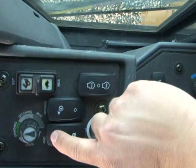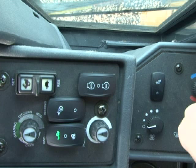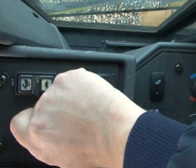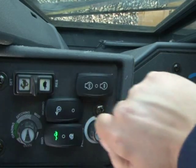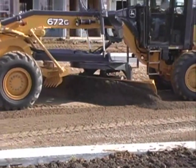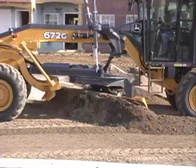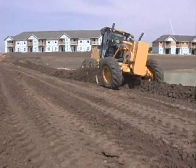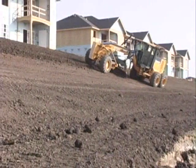Pushing the button activates the 6-wheel drive system in 1st through 7th gears in both directions on 700 and 800 series models. Once on, the aggressiveness dial is used to fine tune the front wheel speed in relation to the rear wheels. When the dial is in the center position with the arrow pointed toward the notch, front tire speed matches rear tire speed in forward and reverse. Turning the knob counterclockwise decreases the speed of the front wheels relative to the rear tandems; turning clockwise increases front wheel aggressiveness. The system can be engaged and disengaged on the go. On 600 series graders, the 6-wheel drive works in gears 1 through 4 only. All-wheel drive is useful in counteracting side drafts, steering in adverse conditions, and working on slopes.